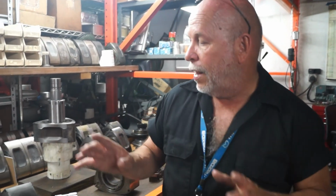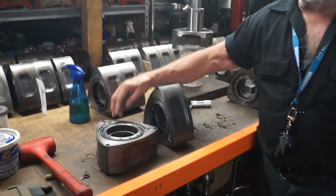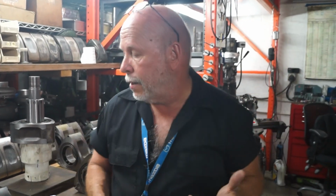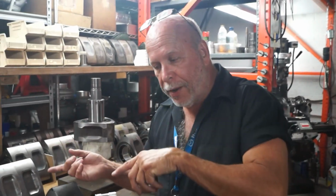On a rotary engine, if you have to do operations like this, you have to take the part off the mandrel, physically off the machine, take it to the mill, do an operation, come back, mount it on the mandrel, mount it on the machine, and spin it again. Whereas with a piston engine, once you have your bob weights made to what I just explained, you never have to remove the part. You just spin it, drill, spin it, drill. That's it. With a rotor, you have to spin it, remove it, machine it, reinstall it, respin it, and hope you didn't go too far.